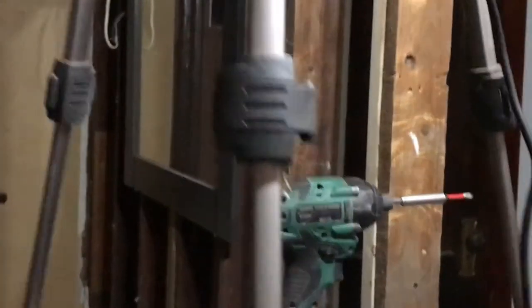That's perfectly level — there's a new one I put in there. See that green line? That one I had to drop down a little bit. That one back there — it is level, it's just out from the wall a little bit. Right here you can see where it's going to be good. The laser level has really helped me a lot. I'm going to do the walls next to make sure they're perpendicular.